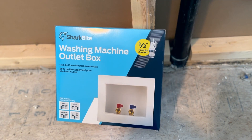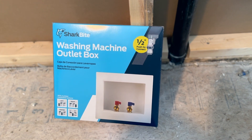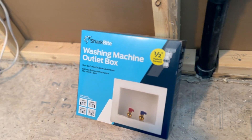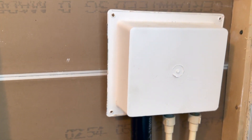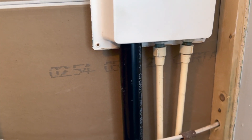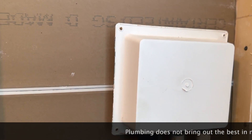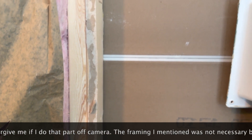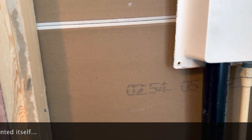To make the installation as clean as possible, we decided to go with the SharkBite washing machine outlet box for half-inch plumbing, which is what we have here. We're going to get this installed. I've got to figure out the current setup, get this box pulled off, which will mean turning the water off so we can unscrew the valves. Then we'll pull this box, fit the SharkBite box in place, and take some measurements to build framing. I'm going to build framing around the new box so that it has good firm support.